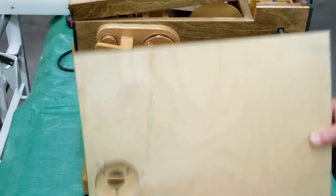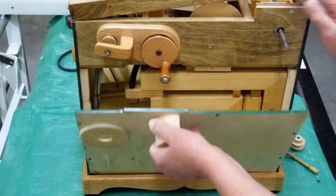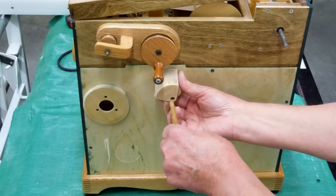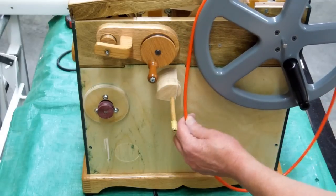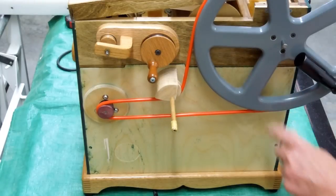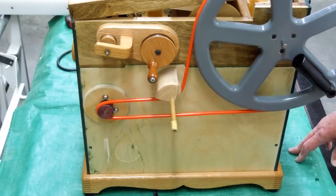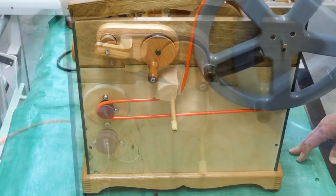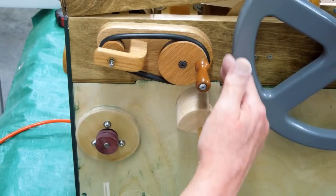This is the outer pulley bracket. I put a blank on the back side of this so that when I put the wood dowel in here I don't hit the pipe. The idler fits up in here. Now we can try it with the belt. That looks good. This is running in this direction, so the motor is pulling on this belt — this side will be just a little bit tighter. So on the return, that idler should run quite freely. We now have the belt clearing the rewind mechanism.